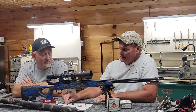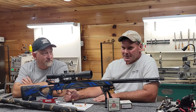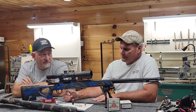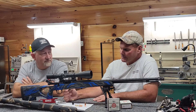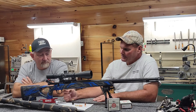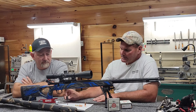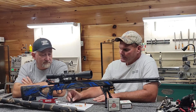This particular bushing is about 40 thousandths right now — I believe this bushing's been shot a time or two. We put a pin gauge on it and it measured right at 40-41 thousandths, and it came out of my big gun that's had a lot of powder run through it. You'll get a lot of shots out of these bushings. For the most part, most people will never shoot a bushing out — hundreds of shots. This is what makes it possible and how it differs from an off-the-shelf muzzleloader.